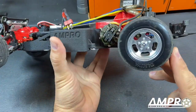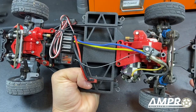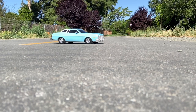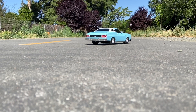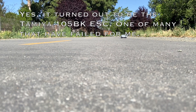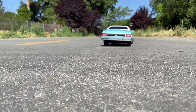Slot mags have been installed. The rears have a two millimeter greater offset than the fronts to account for the wider rear track. I've been driving the car a bit — it's a little dusty just breaking it in. I had one of the steering links come off, and after about 15 or 20 minutes of slow driving it'll stop. If you shut the car off and turn it back on it's fine again, so I'm inclined to believe it's the ESC.